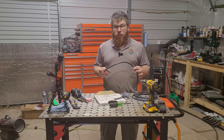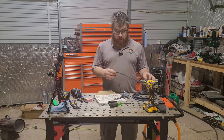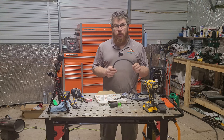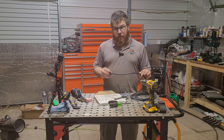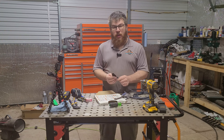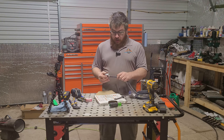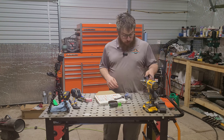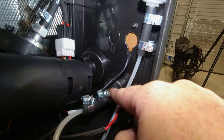You can go ahead and buy a pre-made marine fuel line, but since I want mine to be shorter than what they sell them in, I decided to make my own. Make sure you go with the smallest hose, which I believe is a quarter inch from what I could find. I am using 5/16 inch barbed fittings because I like the way they click together better — they felt smoother and they do fit into the quarter inch line. Again, all parts will be listed down below in the description. I ended up adding another washer in between these two fittings just to fill the gap better.